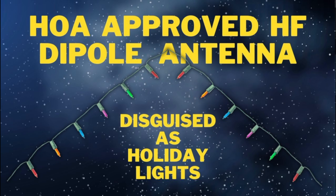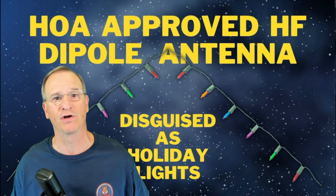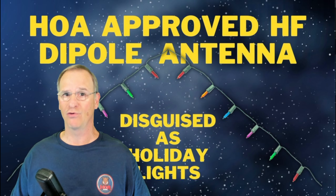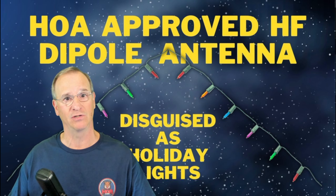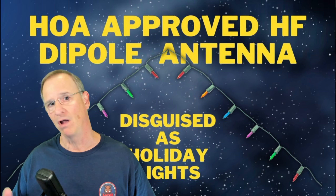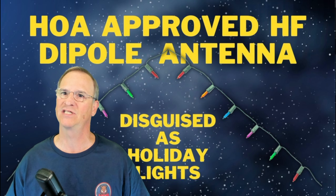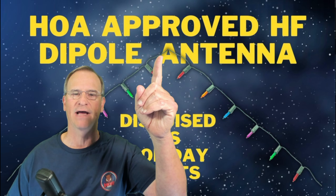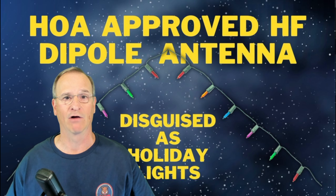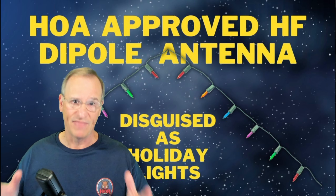This is a thumbnail from the video I did last year where I actually created a 20-meter dipole and put it up on the eave of the house as an inverted V — it worked fantastic. I used white lights and took you through every step of that build. We're going to build upon that. I thought: let's take that dipole, join it right here at the middle to make it one wire, add a 9:1 unun, and make a long wire out of it. Let's just add a piece to the end and see how well it functions.